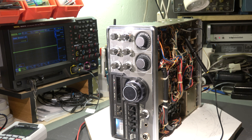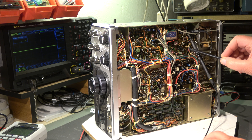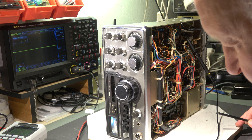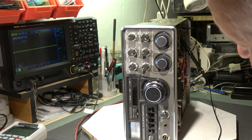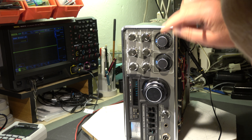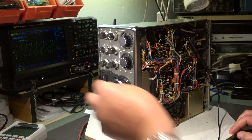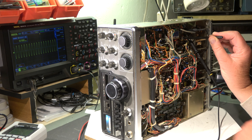Transmitting section, Step 8: adjustment of the generator unit. The generator unit is here with the SSB filter; there's also the FM part we already have aligned. This output has to be aligned — there should be connected a vacuum tube voltmeter. I'll connect my scope. It's a frequency of 10.7 MHz. There is no oscillation in the VFO part; the heterodyne part gets no frequency on channel 11, which is not a crystal. When I go back to VFO or any other crystal I have a frequency, but channel 11 is without any oscillation. Mode FM and send — now we have an output at 10.7 MHz and this output has to be aligned for maximum with this core here, it is T3.